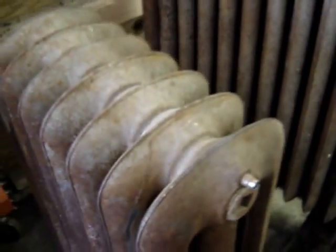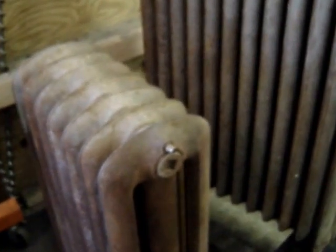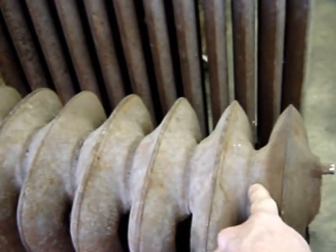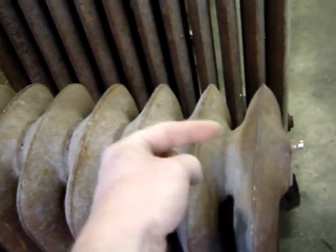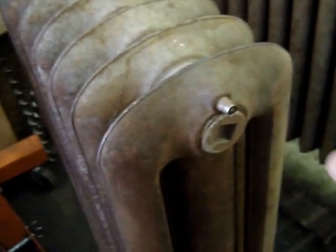I have to figure out if they can be fixed. These are not assembled with threaded rods — they use threaded nipples. One side is right-handed thread, the other side is left-handed thread, and there's a key with two ears in the center of the nipple. If you remove this plug you'll see them, and you can put a tool in there and spin them to get the sections apart. But yeah, 70-year-old cast iron radiators with steel threaded nipples — we'll see.